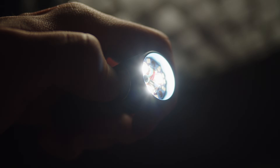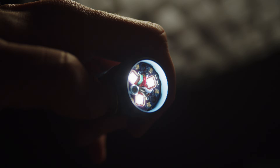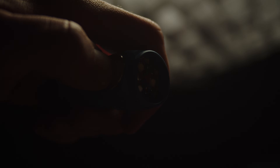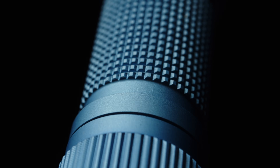The light ships with Anduril 2 — in this case a new build which retains all of its features between both low-voltage double-A and high-voltage 14500. There is a new quick ramp animation when turning on or off and cycling between stepped modes, which does look nice, but it can be a bit confusing when rapidly switching or setting modes. Overall it runs very smoothly and well — it's Anduril, so of course it's cool.